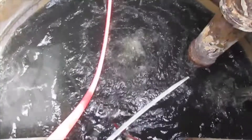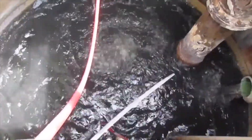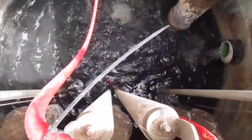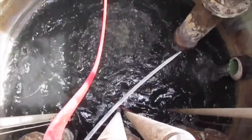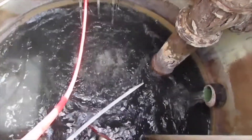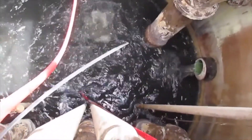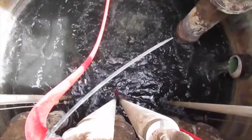60 days after the startup of the Wizard system, the FOG cap is still gone, but now you can clearly see through the water. Notice that there is no longer sludge debris behind the vertical structures of the well — only some small pieces of plastic caught onto the structures. Not only is the well water clear enough to see through, but there is also no black color left. That is because the microbial population in the wet well is now totally aerobic, and the well water is continually holding and passing downstream 4-plus ppm of dissolved oxygen-laden water. This high-DO water also carries aerobes into the interconnect pipes and downstream to other lift stations.